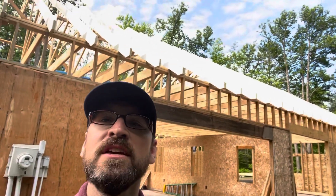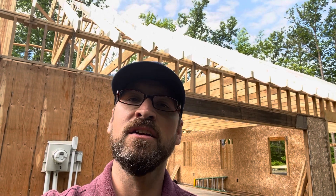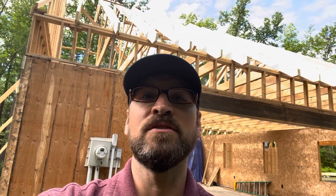Started taking this on this spring and just recently we set the trusses, which was a big deal for us having never done that before. These are really large trusses, so it was something not to take lightly. I'm going to use this video to show you mostly how we braced everything, so if you have a project like this and you're curious about the bracing you can follow what I did here. I'm also going to show clips of the actual truss installation so you can see how we did it with the crane. We had four people on the crew — my wife and two friends — and I'll show where we were stationed to make this happen. We'll go ahead and take a look at the strong backs first, which are right behind me here. That was the first step, done well before we were ready to set, and then we'll walk on from there to see how things were set up and braced.